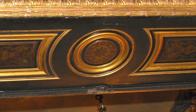Oh, look, this one is really acute. Look at the way the radius shape kind of dies into that miter. So that's a hunting miter too. Very unique joint right there. It has to actually be curved for all the profiles of the molding to line up correctly. It's not a straight miter. You can't just cut it on a miter saw.